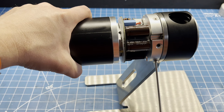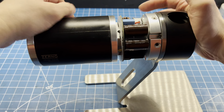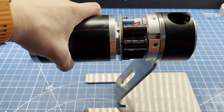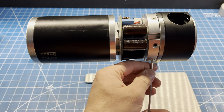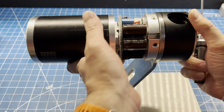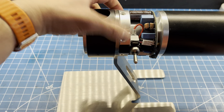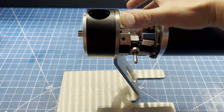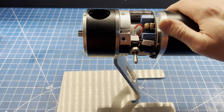Same deal — just rock it a little bit, tighten it all the way, and the screw should go in fairly well. You can also push the motor in a little bit. As you can see, the stand is on the thin side of the tolerance, so there is a little bit of space. I'll go ahead and tighten the top screw, then the side screws as well. Now we can install the other two optional screws — should be a fairly easy fit. But if one screw on either side doesn't fit, that's perfectly fine. The grinder is designed to work with three screws; the five we use are just extra. Okay, that's it for this assembly.